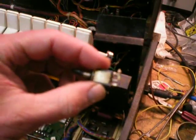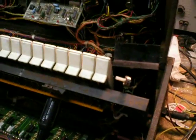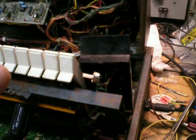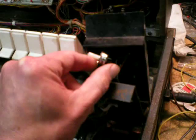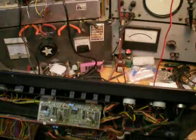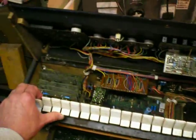I'm doing a modification here. I pulled out the original switch, which just gives you a switch for the glide between a 1-meg resistor and extends your 100K pot with a 1-meg resistor, so you get very little variation. It's really hokey. So I decided to replace it with a 5-meg potentiometer I had in my drawer. Now we get, instead of 3½ seconds, a nice long glide.